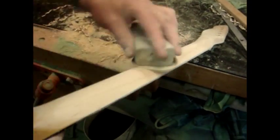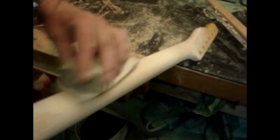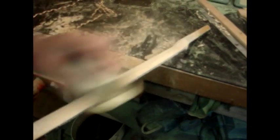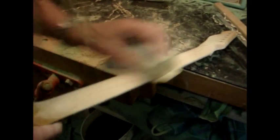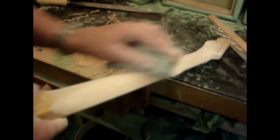Is that a particular gauge sandpaper? This one? Yeah - it's 180. Yeah, it's 180. Before I put any lacquer on this, I shall probably just put some 320 or 400 gauge sandpaper - you need to soften it down a bit more. This is doing a lovely job.